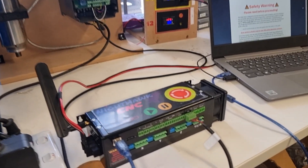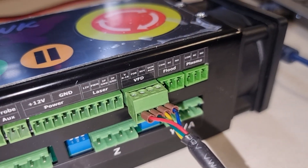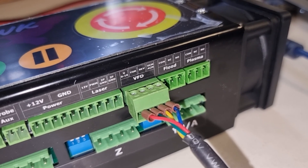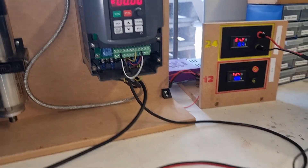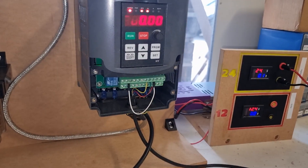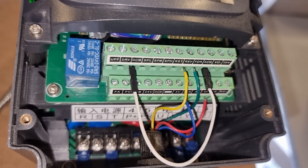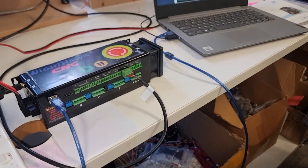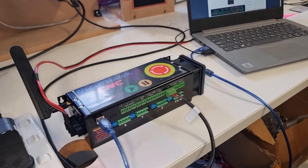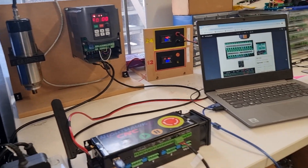The wiring for these VFDs is very simple — just four wires: zero-to-ten volt, forward, reverse, and ACM/DCM. If you remove the jumper bridge, you may be able to wire directly to either the ACM or DCM pin on the VFD — try both and see which resolves your issue. Hopefully this helps you determine what's going on with your HY VFD to get it working on the standard zero-to-ten volt signals. Thanks, and have a great day.